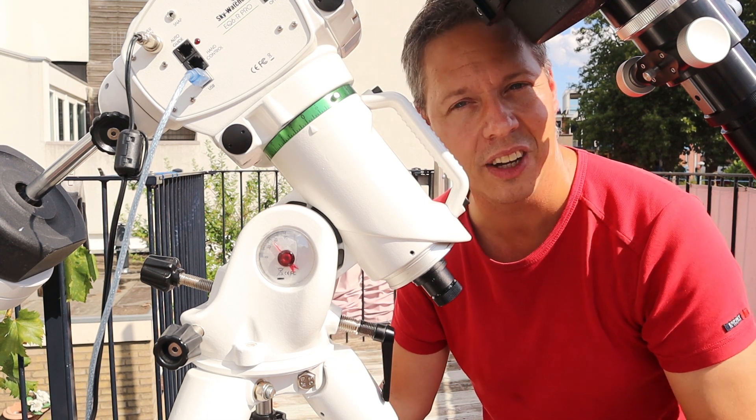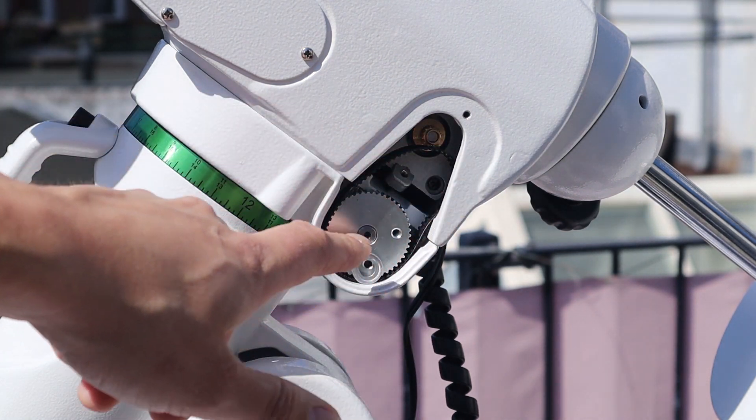If anybody can help us with these polar alignment issues, please leave a comment below. Now, while we're complaining a little — on arrival, my Sky Watcher EQ6R Pro suffered from a loose belt drive. I spent the first night trying to fix it, which turned my first night into a first fight. I eventually fixed it using Teflon tape and a ring in front of the belt drive to keep it in place. Looking online, I found other people had suffered similar issues, so I'd like to say to Sky Watcher: please check that equipment over 1,000 euros or dollars is functioning before sending it to customers.